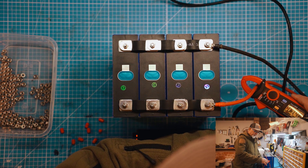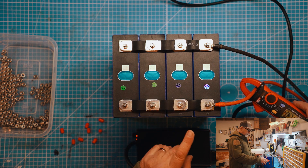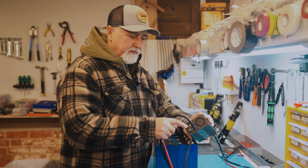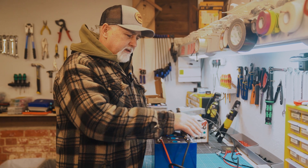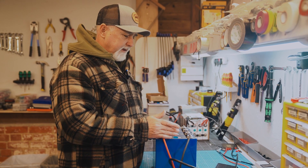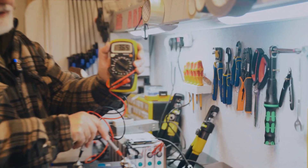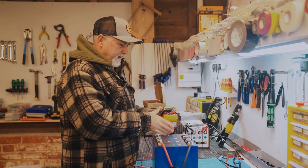We're charging at about 7.4 amps, which is going to take quite a long time. Assuming they're at about 30% state of charge currently, that's several days to reach full charge. After four or five days we have a green light indicating the cells are fully top balanced. The charger slowed right down to about two or three amps for the last day or two — very slow — but it has brought the cells up. Voltmeter reading: precisely 3.65 volts, which we've confirmed with calibrated equipment.